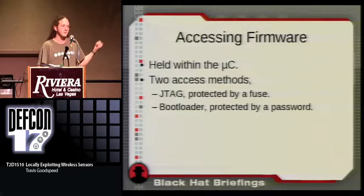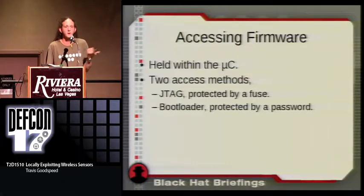This works on the MSP430, on the ChipCon radios — the more recent ones that combine both a microcontroller and radio into a single package where there is no I2C or SPI line between microcontroller and radio to tap. To do this, all you need is a debugger — you can use the official debugger. Just send the command to erase, then send the command to dump RAM, and all of the keys come out.